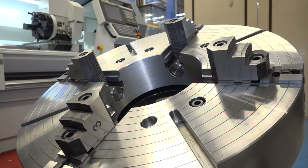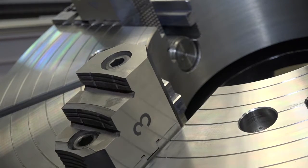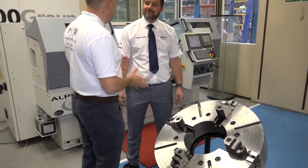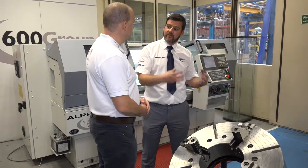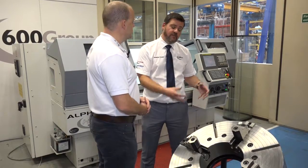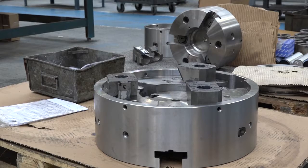A lot of engineers will know the business for the sale of Colchester and Harrison machines, but this type of chuck — can you buy it for any machine tool? Will you supply and fit any machine tool? Most of the larger chucks are manufactured with the actual mount for that particular machine, so we can manufacture to any requirements. The smaller chucks, as with the three-jaw, come as recess mounts, so we supply an adapter to mount to the specific spindle nose.